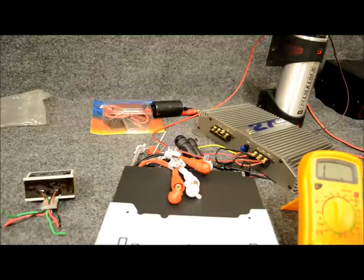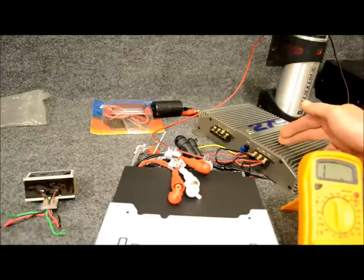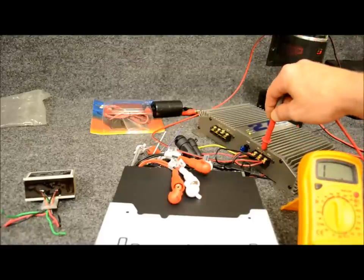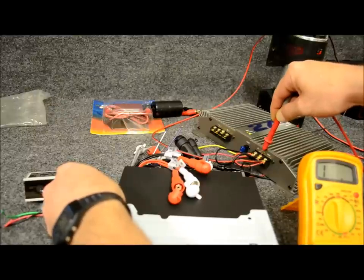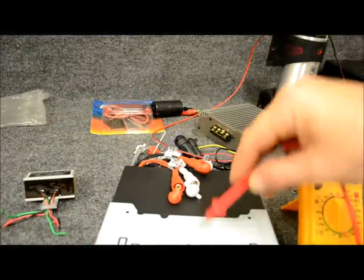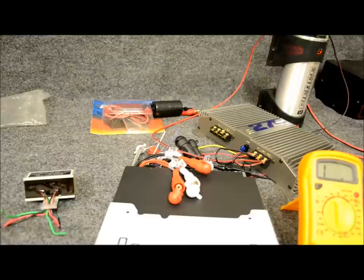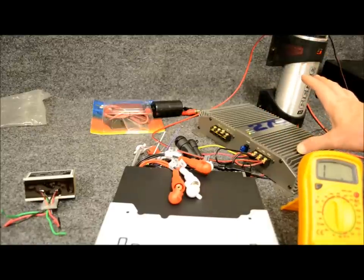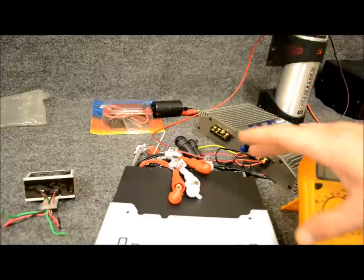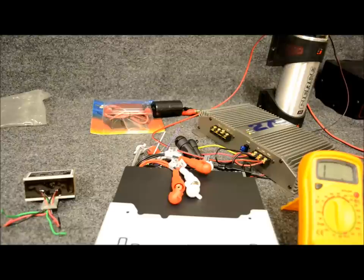The moral of the story is this: if you have your radio and you're testing it for the resistance on the ground circuit and you're getting say 5.5 ohms, then go back to wherever your amplifier is located and do the same thing — one probe to the ground terminal on the amplifier and one to the chassis. If that says 7 ohms, and your capacitor reads 9 ohms, you got lots of problems. The difference between the impedance or resistance from one component to another is called the ground loop. The more ground loops you have, the more problems you have — it's like compound interest. You have a dollar in the bank at 3%, next thing you have $1.03, then $1.09, and it just compounds down the line.